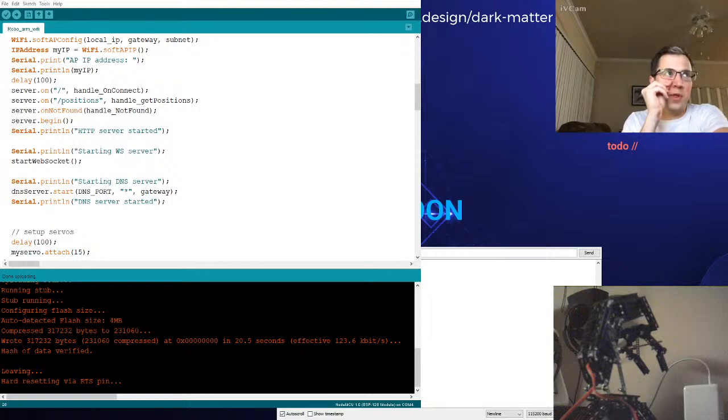Set highly used positions. Ultimately, I want the user to have full control of this arm. So as soon as you start it up, we need to write an initialization function to calibrate. Essentially, it should default automatically, but you never know. So we need to play around with that. Make sure the web page delivers the buttons at 50%, right in the middle, 50% to the left, 50% to the right. We don't really know where the servo may be mapped to, so we need to extend all the way both ways, get those values, and then land in the middle for everything essentially.